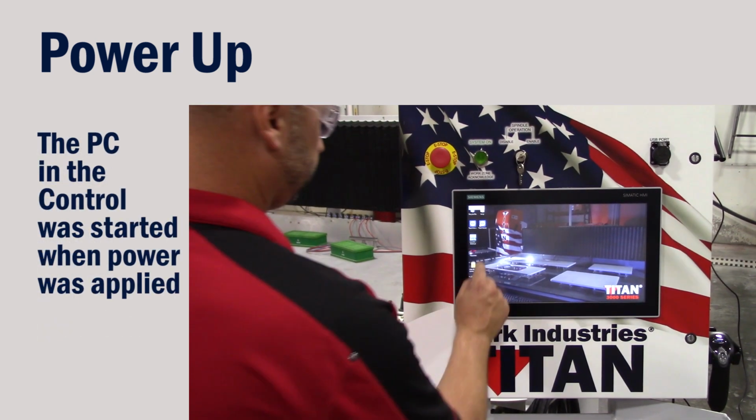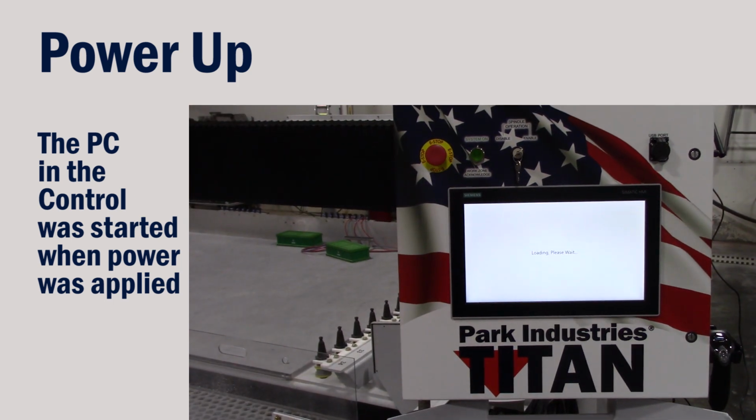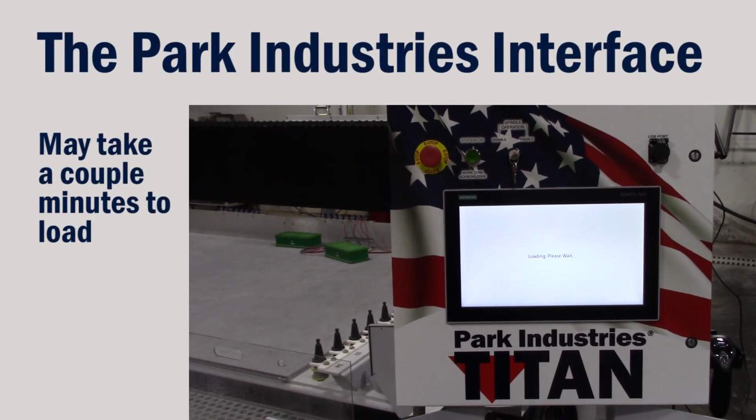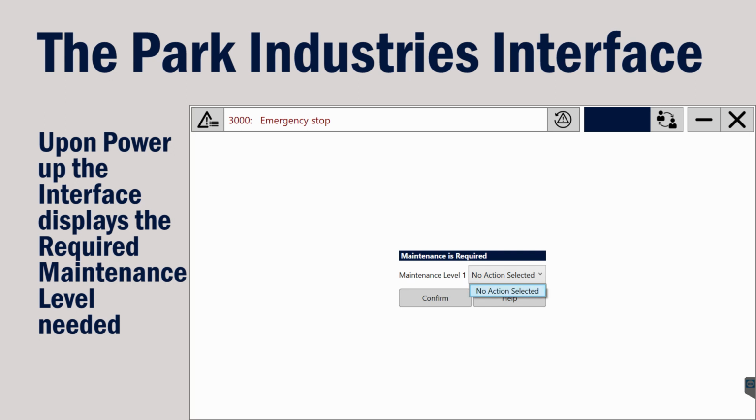Complete the power-up by double-clicking or double-tapping on the Park Industries icon to start the interface. It may take a couple minutes to load. The maintenance screen is the first screen to be displayed. Perform the required maintenance and then choose Acknowledge from the drop-down.